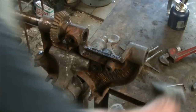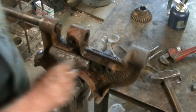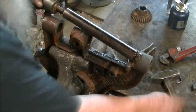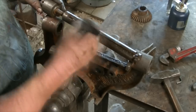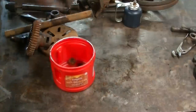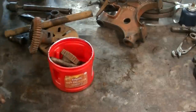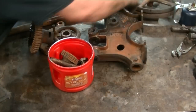This took a little bit of time — about 30 minutes worth of wiggling. I filed the end down where I tapped on it with the hammer, and a little more. This is our keyway drive slot that matches up with the gear. All the little components go into a bucket, and the larger components we'll just stack everything back into the vinegar.